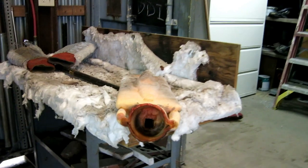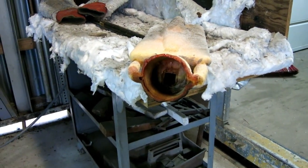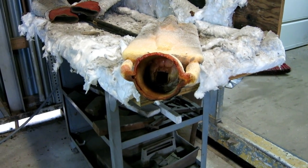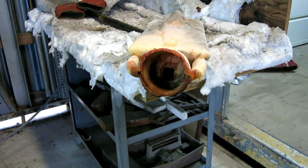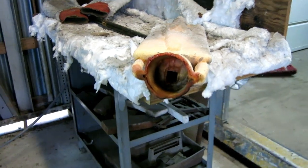I want to show you that the mold is not perfectly clean — it still has carbon deposits and maybe a little bit of wax. If you were to pour bronze in it like this, you'd have a steam explosion — it would be awful, because bronze is so hot it would react to all that carbon and junk. So we're going to fire it; it will be clean white when it comes out of the kiln.